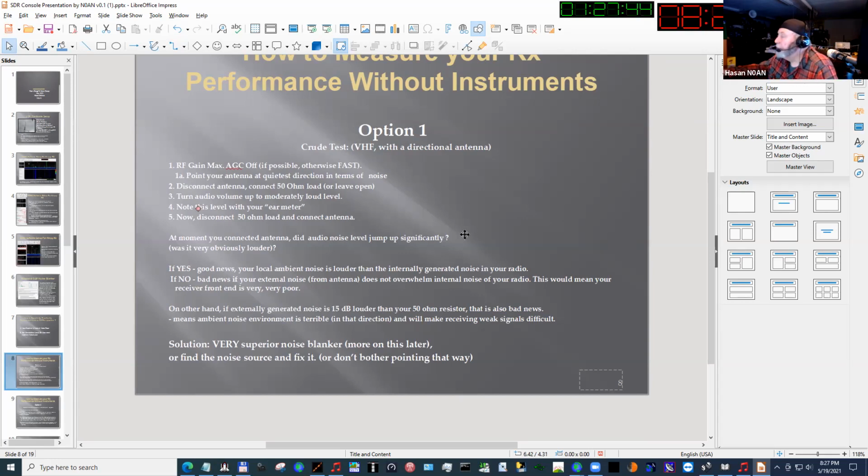I've got a 15 to 17 dB noise at a bearing of anywhere from 60 to 100 degrees. I'll move my antenna to 50 and put the noise down the slope of the antenna. I'll move the antenna to 130 and put the noise slope down the antenna. And the pattern of the antenna is broad enough that there's no real loss in signal strength, but I have reduced the noise.